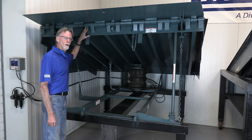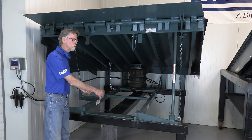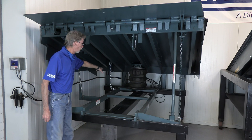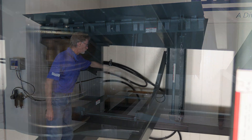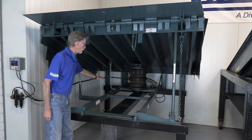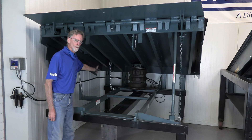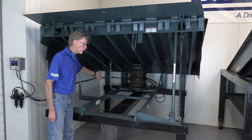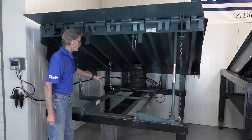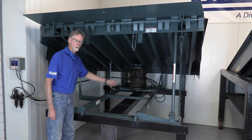This particular unit we call the CA leveler or central air leveler. The frame configuration, as you can see, is pretty much identical to either the hydraulic or the air powered leveler. The biggest difference you're going to see is where that bellows is mounted — it's mounted to the channel frame. It is important to shim underneath where that channel and the bag area meet. Other than that, all the other areas of shimming are identical to the prior two units. The front is the same. The welding of the rear hinge angle to the curb steel is the same. The biggest difference is where that cross member is where the bellows attaches — you need to shim underneath that area.